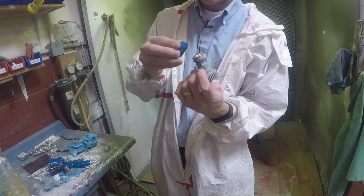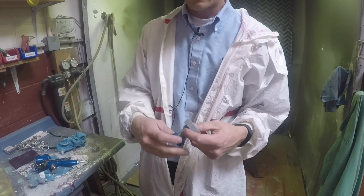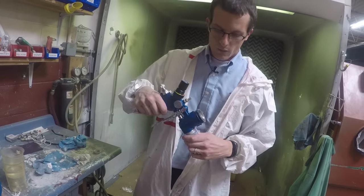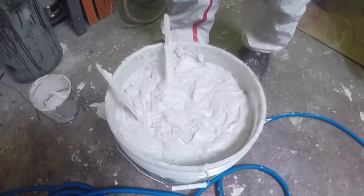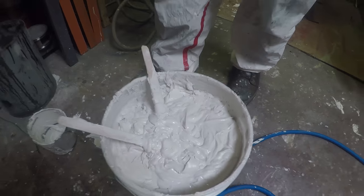Three tip sizes are available for this unit: four, six, and eight. Others have ten and twelve as well, so you can spray some very thick material. We didn't really thin this material — we added about a quart of water to it, so it's hardly thinned at all. You don't really need to thin the material to spray out of the unit.